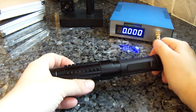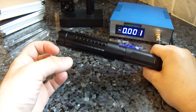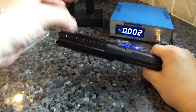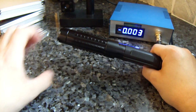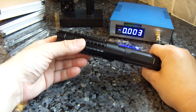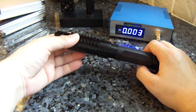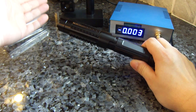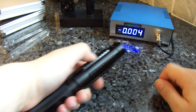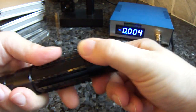The diode is sitting in a brass heatsink module — it's not an actual 12mm module but a larger brass heatsink that sits within the head press-fit, with the diode pressed into that. The driver is a linear driver set at 1.27 amps, which is pretty good for the power you're getting out. Also, a nice upgrade on this version is that the front lens portion unscrews.